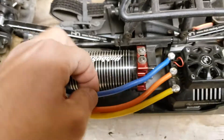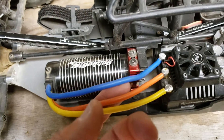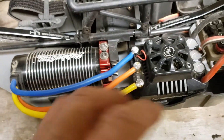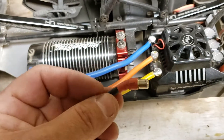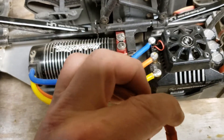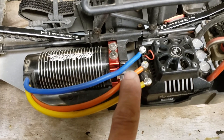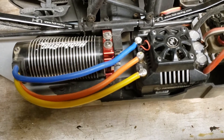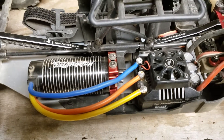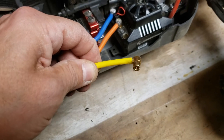So I went in there today and asked what I could do. I was thinking about maybe putting a splice in, since I just needed a little bit extra. Once we looked at how bent these things get when they go into the ESC and get bent over, he ended up mounting the bullets on the side — he soldered them in through the side. I'm going to pull one out and show you.